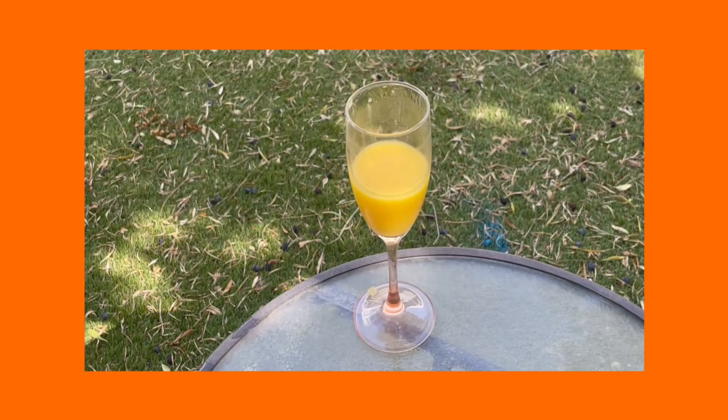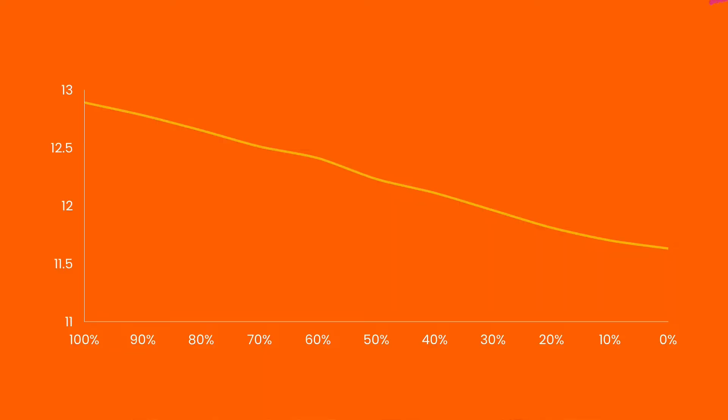You also can't fully discharge these batteries without damaging them. It's recommended that you only discharge flooded batteries down to 50%. So those 100 amp hours you thought you were buying, you can only use 50 of them — that's like being sold a mimosa and then being told you can only drink half of it. When we talk about that 50% discharge, a lot of people get confused and think the voltage is going to go down 50% as well — this isn't the case. Your voltage will go down a little bit as your battery discharges, but you'll still be in the realm of 12 volts. It's the amp hours we are cutting in half, not the voltage.